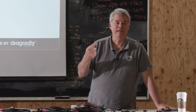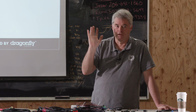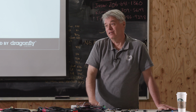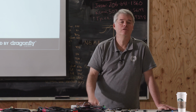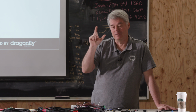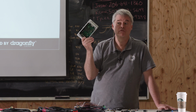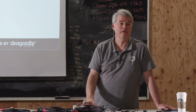If a battery is truly designed to the RVC spec, plug and go and you're safe. Whether or not a battery is truly designed to the RVC spec, I can't answer. And specifically, the area that is often the trouble is that forewarning, because it's a unique thing for alternator regulators because of the high residual magnetism in the alternator.